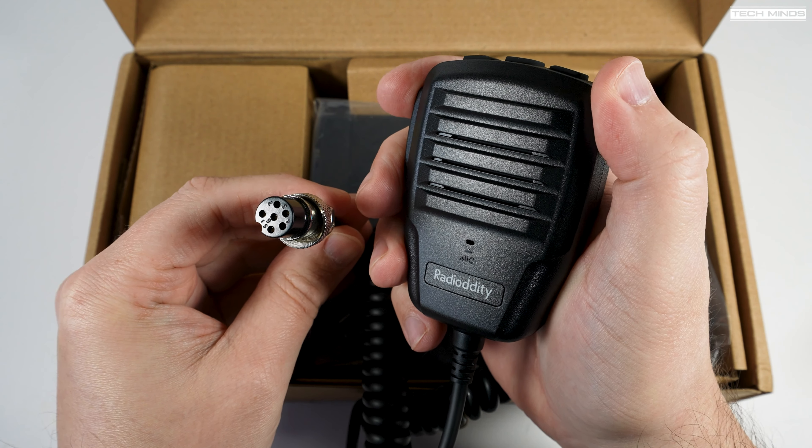So let's take a look at the actual modification. First, we'll take off the bottom case — the case with the speaker side — then just locate this little jumper here next to the white wire. As standard, that white wire will not be cut. The jumper will normally be across pins one and two.